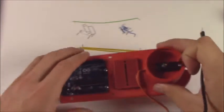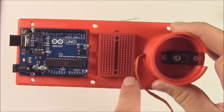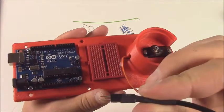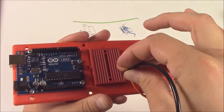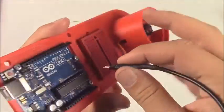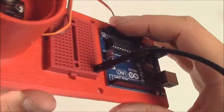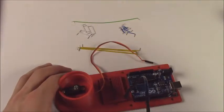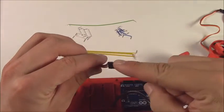breadboard. A breadboard works by rows. Each one of these rows is basically a connected wire. So if you plug anything into one of those rows, it's connected to every other dot in that row. So we'll plug this in. It's going to go in sideways so that the two plugs are in two different rows. You can kind of see that there. There we go. Now we have a positive row and a negative row. So we know where our power is.